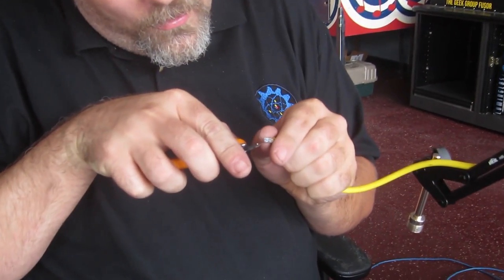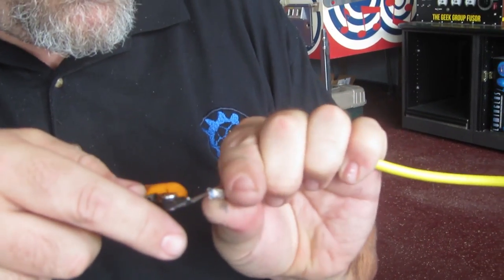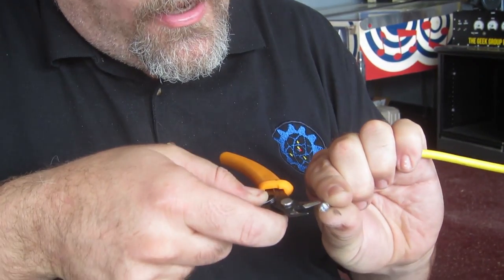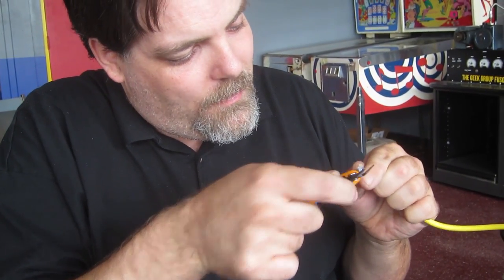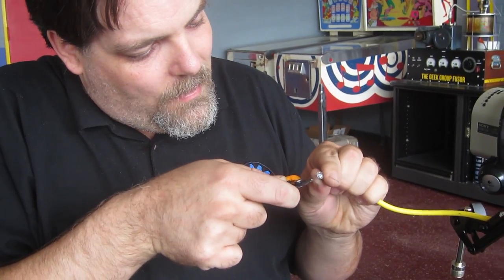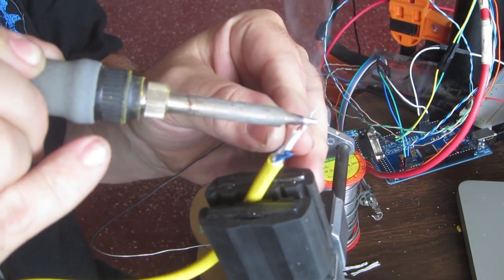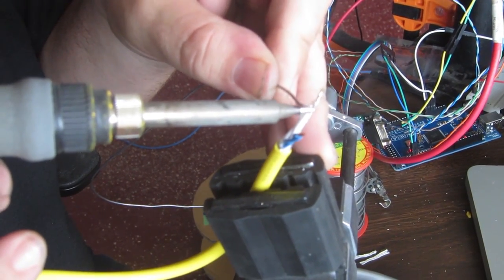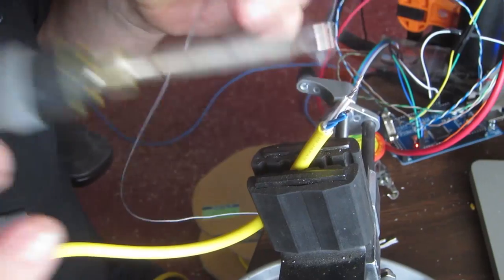And now I just debraid this end. Debraiding this wire is the most time-consuming thing. Clifton Sr. does it a fast way where he actually cuts the braid open at the bottom and just pulls the wires out. I think it looks a little messy. But oh well, I'll do it the long way. It doesn't take that long. So, heat everything up, and eventually the wire will just wick up solder and turn solid. These wires will do it faster, especially if they're heated from both sides because the solder is hot. There we go.